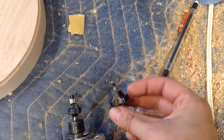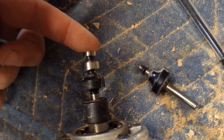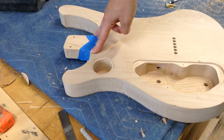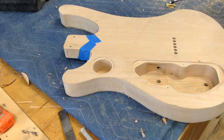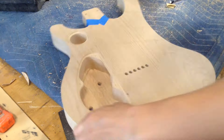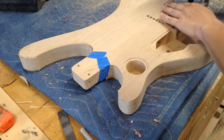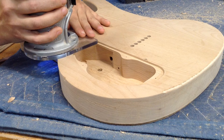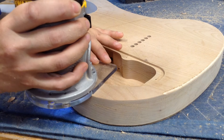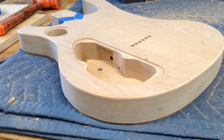For the bottom he wanted a little bit of a round-over. I had a similar issue where the eighth inch round-over bit I had didn't have the bearing I needed, so I swapped out the bearing — these bits all come with removable bearings, so that was pretty easy to do. He had blue tape marking where to stay away from the neck with this round-over, so this was pretty simple, just on the back. Once I swapped out those bearings it left a little bit of wood fuzz, but everything cleaned up really nicely with sandpaper.